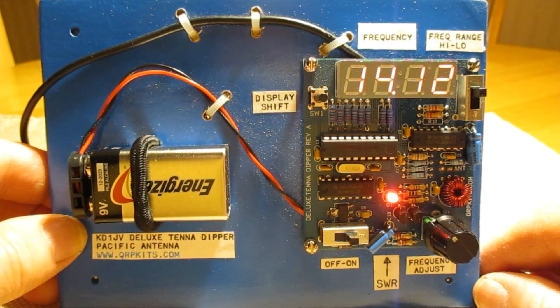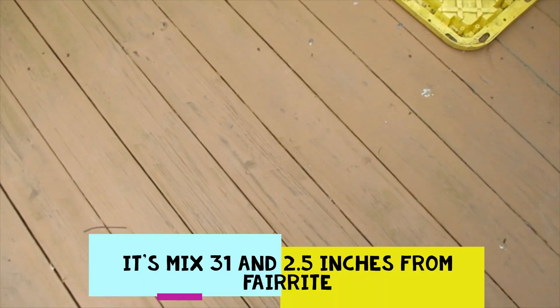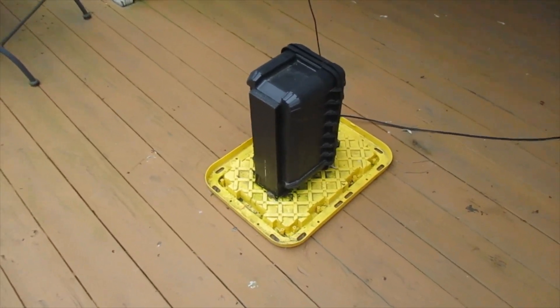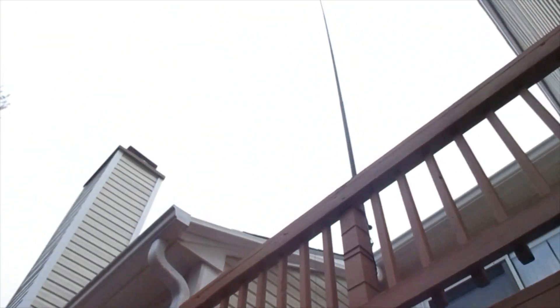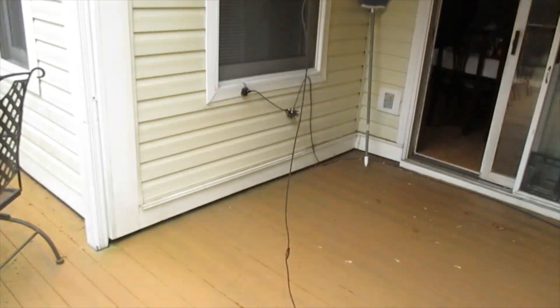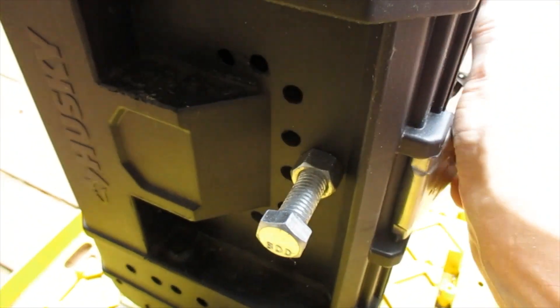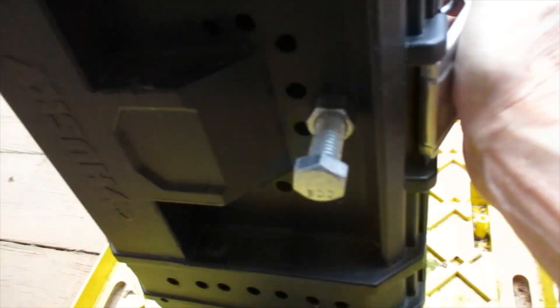I suggest we adjourn to my shack and try it out to see how good my antenna is. My wife and I live in a condominium townhouse — we're retired. I have a 63-foot EFH 4010 antenna mounted as an inverted L, 30 feet high in the backyard. Over here in a Home Depot toolbox is the matching unit. I have to tell you it's probably the best antenna investment I could have made given my circumstances here.